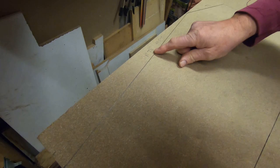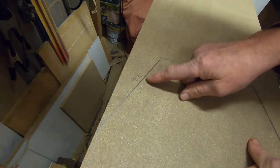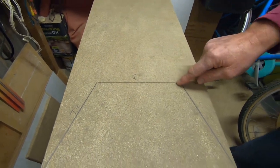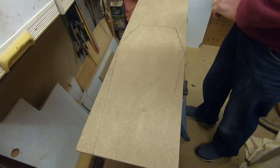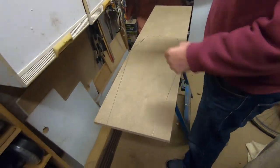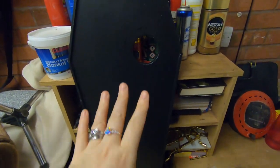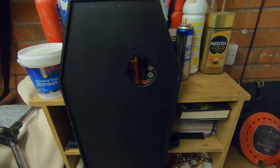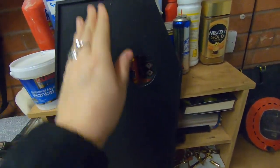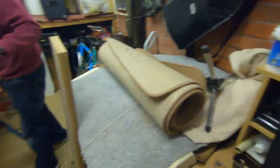Measurements for this: we've put it as one foot seven and a half inches, which is 49.5 centimetres — that's the longest part. Then eight inches across and eight inches down at the bottom. We've used the template already, but my father-in-law did the original off his own sizing, so we've just gone off that. It's quite a good size for a tray. The only difference is this hole will not be in it — that's a bath-specific feature for a glass. With a tray it's going to be left as normal, and we're going to be putting handles, one at the bottom and one at the top.